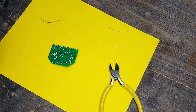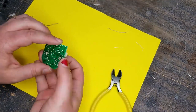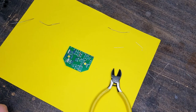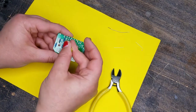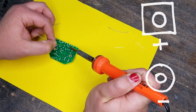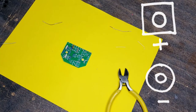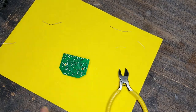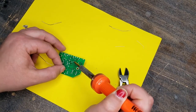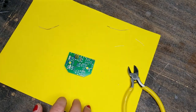Now that you've got your resistors in, we need to put in capacitors. An important thing to remember is it's just like putting in resistors, except some of them might have polarity, which means they have to go in in a particular position. Look to see if the pad around the hole has a square or a circle — if there's a square, the positive side of the capacitor has to go through that hole, or your pedal won't work and you might risk blowing the capacitor. Fortunately, this Mosrite Fuzzrite doesn't have any polarity on the capacitors, so I can just put them in their right spots.